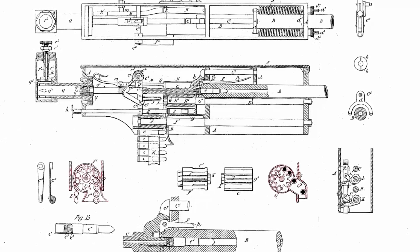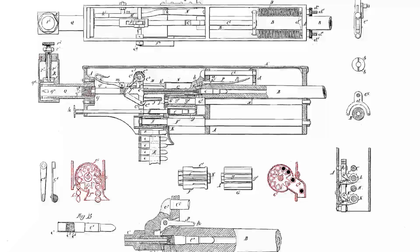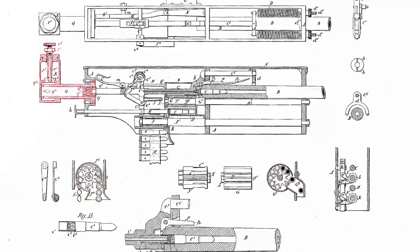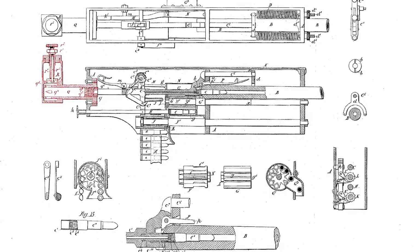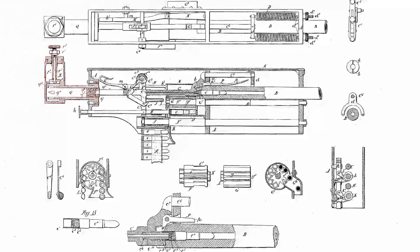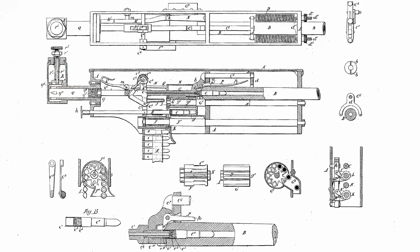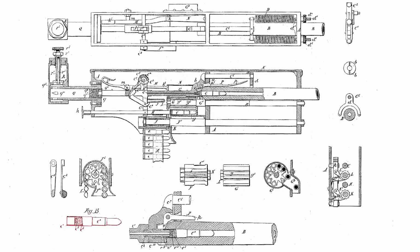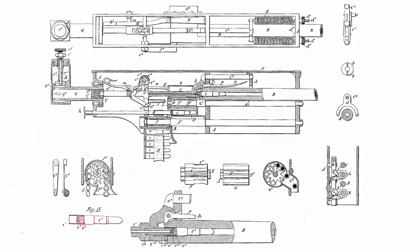Forerunner used 2 star-shaped spindles to feed ammunition from a cloth belt. It had a hydraulic buffer at the rear with a reservoir. This was done to allow Maxim to change the resistance on the breech at will. This would aid greatly in experimentation. The action was unlocked, and while nominally recoil operated, the activating factor was a piston fitted into the base of each cartridge, which was blown back into the breech when fired. So this is a primer activated gun.